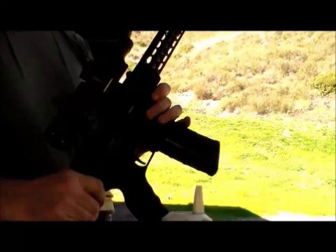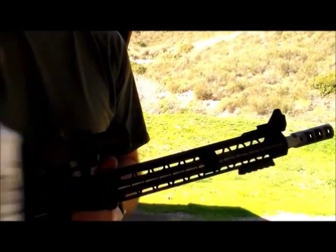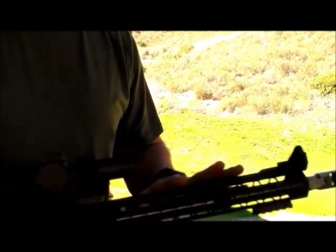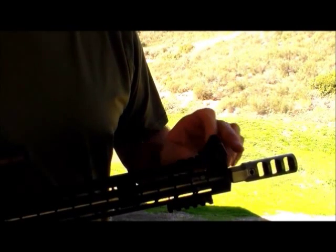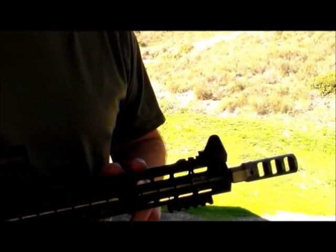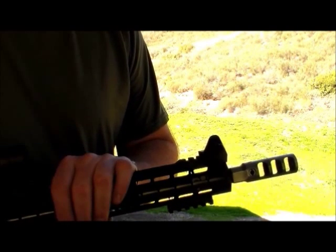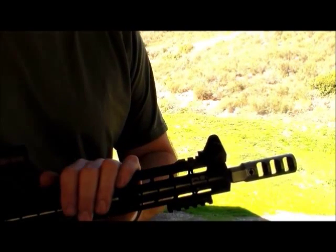I didn't show you all of the drillings and re-drillings I did. Suffice to say, what I ended up using was the 3/16ths. What I did along the way was after I got to the 9/64ths on the top and the right, I started drilling out the top first to tame the muzzle rise, and then I started opening up the right to tame the yaw. So what I ended up with for my shooting was 3/16ths on top and on the side.